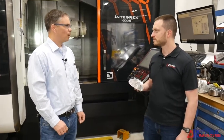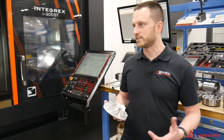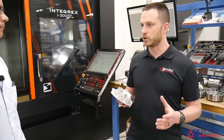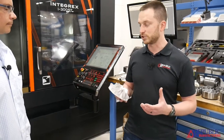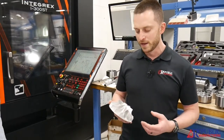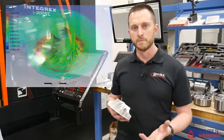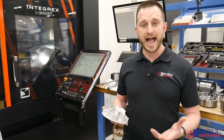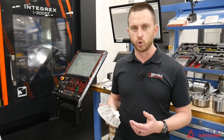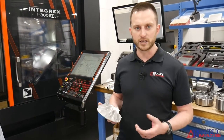So you're holding an impeller — actually, that's for the next generation RBX150. Tell me a little bit about the software and what went into designing that. When you're designing something that's aerodynamic like an impeller, you're actually working inside the physics, which is essentially chaos theory, and you need to find a way to predict where each individual segment of the air goes. It's extremely complicated. So we use a software called ANSYS CFX — it's a CFD, computational fluid dynamics software. What it does is statistically map all of the flow through the impeller so we can figure out where we're adding power and how the behavior is going to result. It allows us to get a very accurate prediction of our performance before we ever put a tool to the metal, which gives us the opportunity to do a lot more testing and really refine the design without spending as much time and money up front.